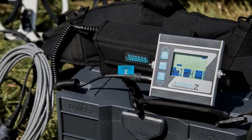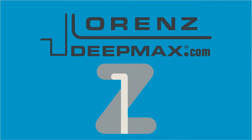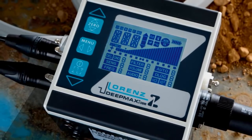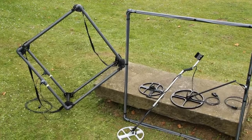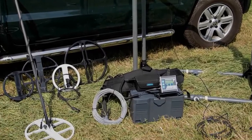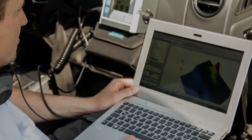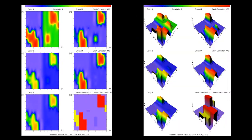The specially developed ground balancing and metal identifying circuitry is suitable for searching at depth and gives detailed information on the probable kind of metal located. The Lorenz DeepMax Z1 can be used with a wide range of different search coils ranging from small single or induction balanced double D to large frames with single or differential measuring technology. The Z1 also offers a GPS supported data logging function in order to generate color or contour maps in a matter of minutes on a computer. A hardware and software kit is available for this function.